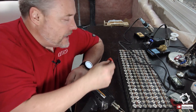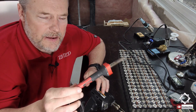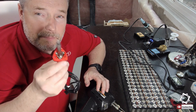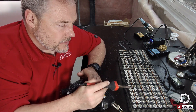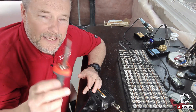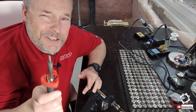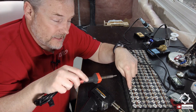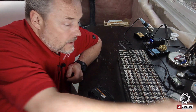So I went and bought this soldering iron, which I think is a 60 watt. It has little LEDs on the front. It's actually kind of nice for doing small things, but when you start trying to get these batteries and bus bars to heat up, it becomes a problem. It takes a long time to get hot enough, so I end up holding it on a cell for a long period of time — and that's not a good idea, because the iron is transferring heat into the cell, and the longer it sits there, the deeper that heat transfer goes.